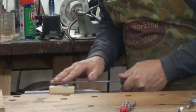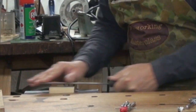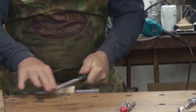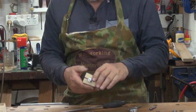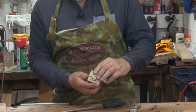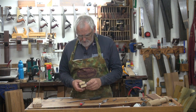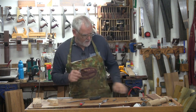I'm just leveling it off. If I had a milling file it'd be quicker, but this is okay. That's just flat now — the mark that was cast on there is gone. To hold it in the vice I've got two little V's cut into a piece of timber. Put the bolt in there and when you tighten it in the vice it's not going to twist, and more importantly it doesn't wreck your vice. When we come to cutting it to length, it's also a great little trick — you can put it in there, hold it in the vice, and cut it without it twisting.